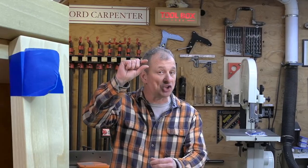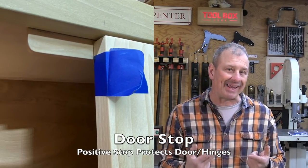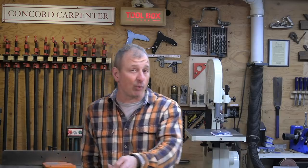After adding the doors, we put a bottom and top door stop on the inside of the cabinet to provide a positive stop and backing for the door in case a child bumps into it. Now we move to the job site — we're ready to install. We've got to remove the baseboard so we can get the base cabinet up against the wall.